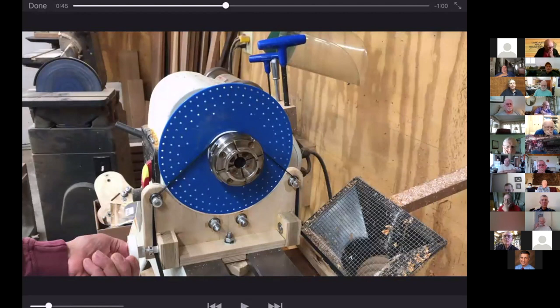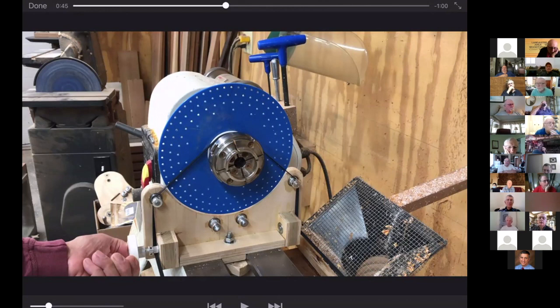Directly under the blue plate, you'll see these metallic things are all 20 tooth sprockets. The sprockets are all mounted on, I opted for 5/16 versus 1/4 inch, because I wasn't sure how much deflection you might have under the tension of the belt. I wanted to make sure I didn't get any tendency to run off. So I used a Home Depot 5/16 shaft to put these sprockets on. You could do it without any ball bearings or oilite bushings or anything. But I chose to use them. The cost I gave you included 30 roller bearings for $11 from Amazon. They're Chinese made bearings, all sealed, and it's twice as many as you need for the job. I have double bearings at each location to make sure the rod stays straight, the spool stays straight.